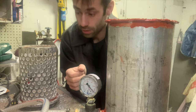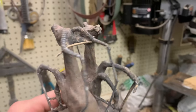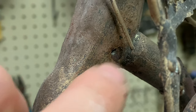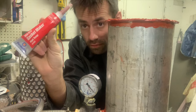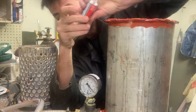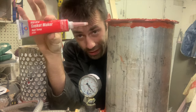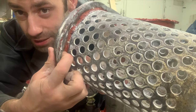That time it worked perfectly. You can see the surface finish is nice and smooth — no defects in any of the important places. There is one small hole that'll be super easy to fill; the rest of it is just perfect. For the gasket I used high-temperature gasket maker and put it on wet before placing the flask in, and it sealed right up. I'll have to replace the gasket every time because it burns up, but this stuff isn't that expensive and it cleans off fairly easily.